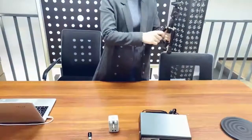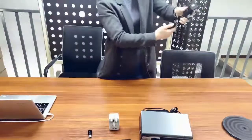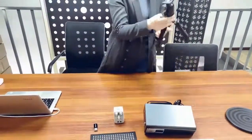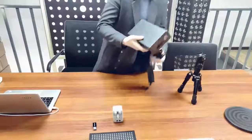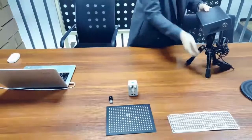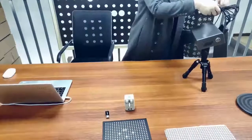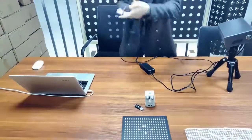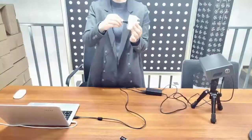Now let's handle the hardware. Firstly, set up the tripod. It's a universal design from 24 cm to 49 cm height, 360 degrees rotation. Just push inside the groove and adjust the legs as you want. Then slide the scanner head into the tripod slot. Scanner cables are connected to the body, which helps reduce plug wastage. One cable goes directly into the PC USB port, both 2 and 3 are compatible. Another cable goes into the power supply. The universal socket offers help sometimes.